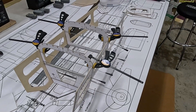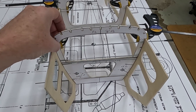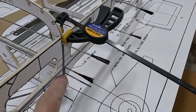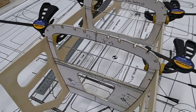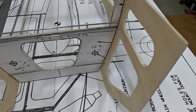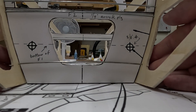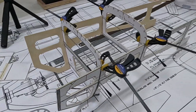A couple of observations with this initial assembly: I like the push rod idea - it's nice to get the former square with the sides. The holes should be really quite snug to whatever wire you use, because when you bring in the doubler at an angle it helps hold everything in place. It's going to be a little bit fiddly trying to glue this up.